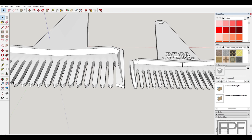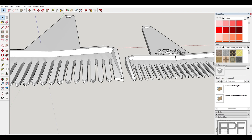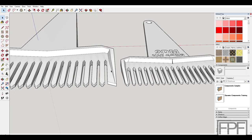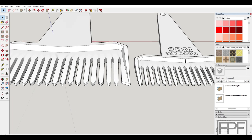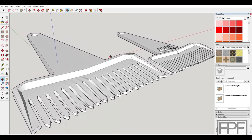I went through two design iterations until I was satisfied. I had this thinner first, with this last piece kind of coming in at an angle. What I found was there just wasn't enough material as it thins out in this direction — in FDM with PLA or PETG it might have been stiff enough, but in TPU it was not. It was just bending inward as I went through the resin vat, even going real slow. But increasing the width here to support it, it stays in place. You can feel that it stays tight against the wall of the resin vat. It doesn't move in at all — you can work back and forth in the resin vat and it is snug in there. I think that pretty much covers the design.